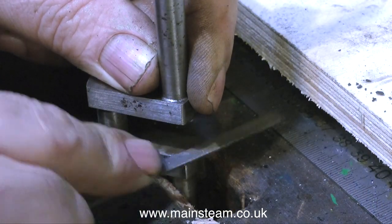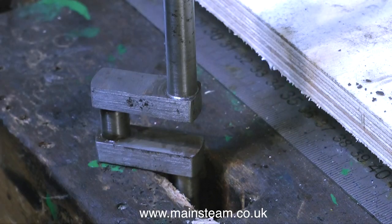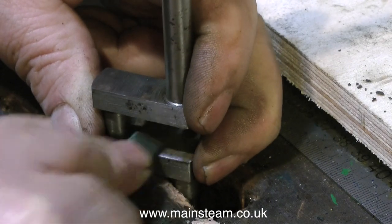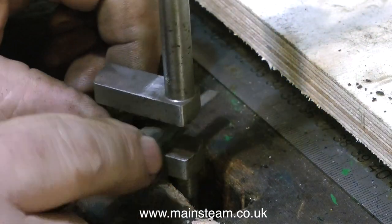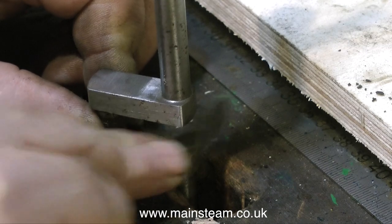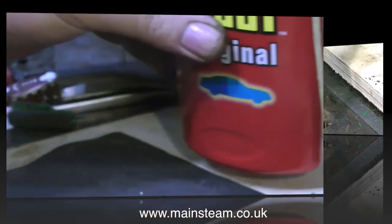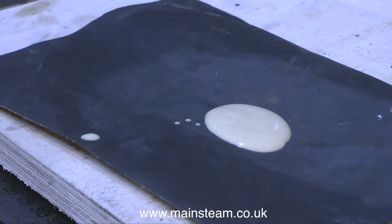My old workbenches in the workshop are woodworking benches, and they have rectangular holes in the wood along the front, which are normally perfect for dropping nuts and bolts through onto the floor, but they're also useful for doing this. As you can see, I'm putting the crankshaft down into the hole and I can attack it with a needle file. Once I've been using the needle file for a while, I wrap some wet-or-dry sandpaper around the needle file and use that. And then finally, as we get towards it looking a bit better, I'm using some T-cut on some 800 grade sandpaper, and this is to clean up the main crank webs.